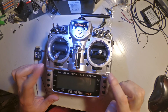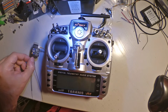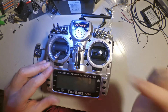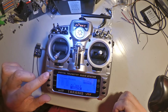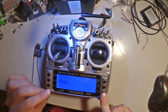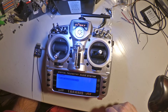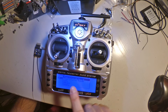With that done and connected, we simply turn on the transmitter. Beforehand, I have copied the proper X4R LBT firmware to the Taranis SD card in the firmware directory, so we can find it there. I'll show you. You can long press the menu, then one page and there is the SD card. I browse the firmware directory and press ENTER to step in. I have only the X4R LBT firmware here. I select it and long press ENTER.